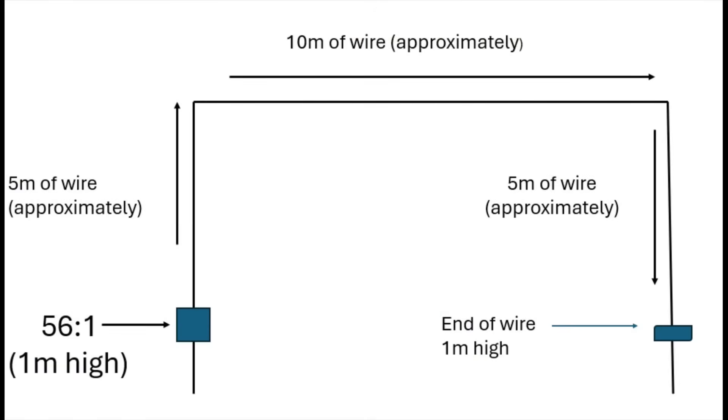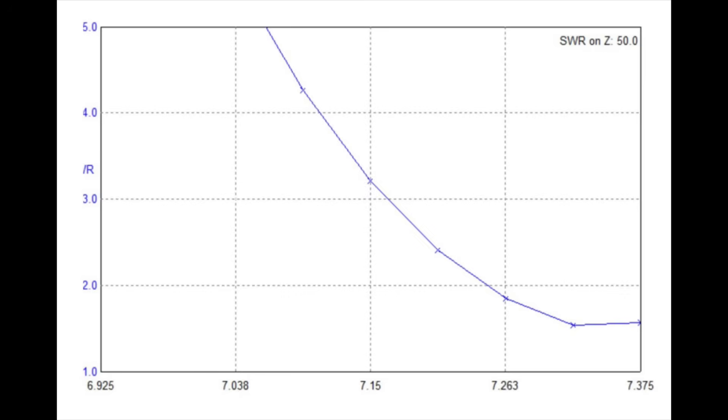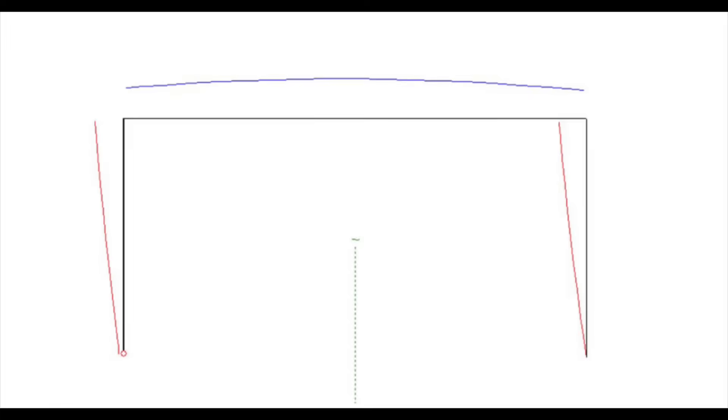The reason we had a moderately high SWR is because when we bend the half-wave into that shape, we are electrically shortening the antenna. As you can see from the SWR curve, we really had a good SWR quite a bit out of band, higher up — but not a problem. Less than 3 to 1 SWR on 40 metres is absolutely nothing to worry about. Also, by bending it into that half-square shape, that 10-metre horizontal bit — where the maximum current comes on 40 metres, because it's a half-wave — was nice and straight at a 6-metre height, which gives us that lovely local coverage we're looking for in the daytime on 40 metres.